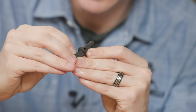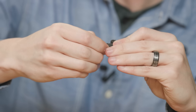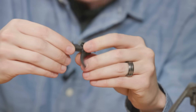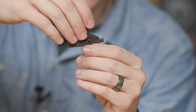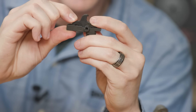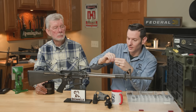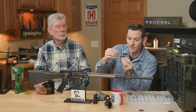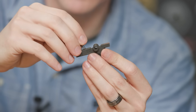If you wind it the right way, it'll just go on in. So that goes just like so, and whenever you have your disconnector on it, it compresses — it can go down and up nice and free, no issue there. Now the issue — what people do that's wrong — is they'll put it upside down because they were met with resistance; it goes in easier that way. So let's put it in upside down. That's nice and easy.